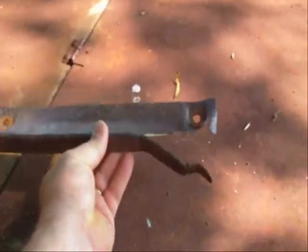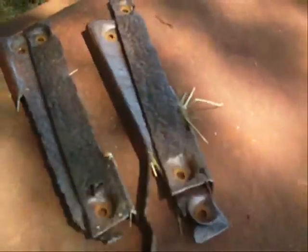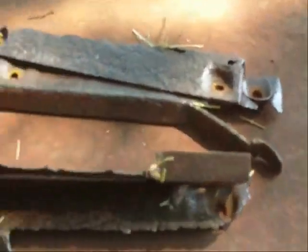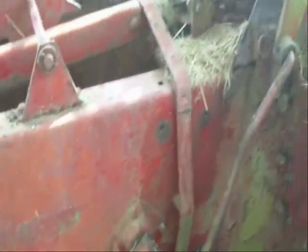And I was going to show you my hay stops. If you can see, they are worn out, and 4 of them on here. Every one of them. Some of them are worn out more than others, but those go inside here where those 2 holes are at the bottom. There's 2 on each side, and it helps keep the hay from moving backwards too, in addition to the hay dogs, the bottom dog and the top dogs. There's 3 on the top. Right there's 1, 2. Well, I guess there's only 2 on the top. No, there's the other one. There's 3 over.